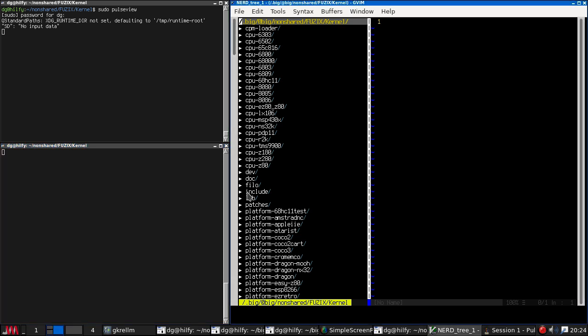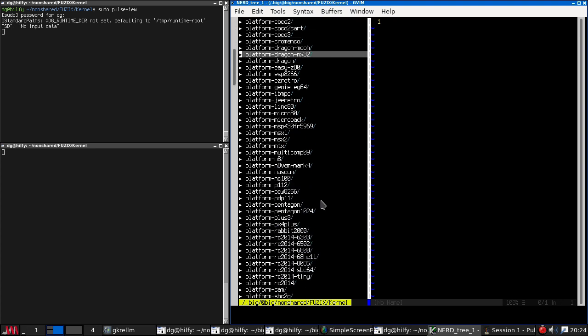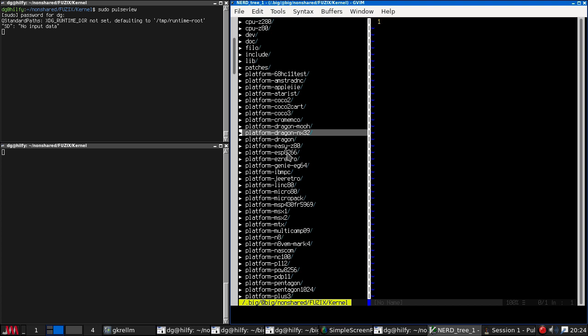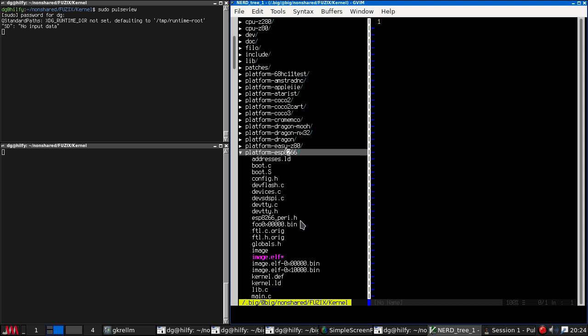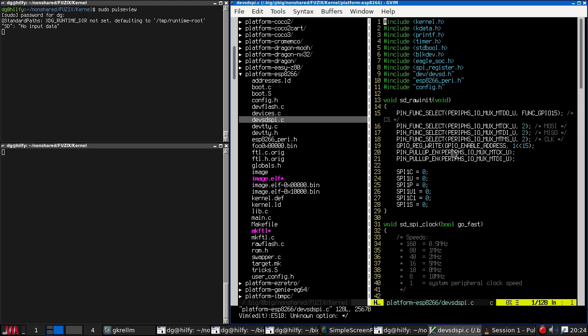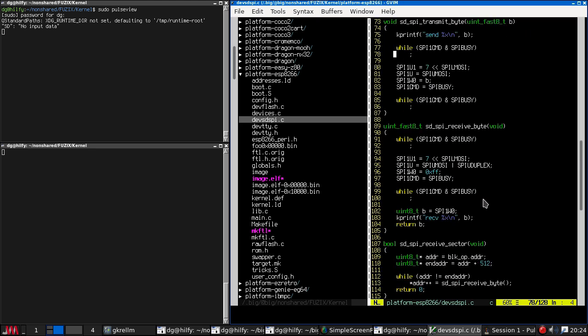The story so far. I am attempting to port Fuzix to the ESP8266. I have nearly all of it working, except putting the file system on the internal NAND flash is achingly slow, so I'm trying to make the SD card interface work, and I'm having endless trouble. It looks like I'm correctly sending bytes to the SD card, but the SD card never responds.